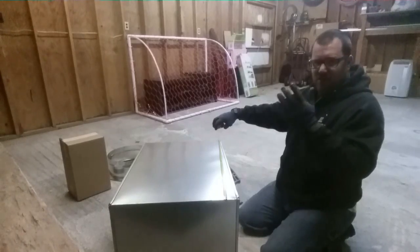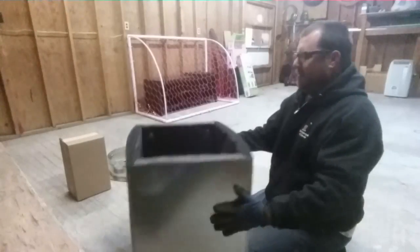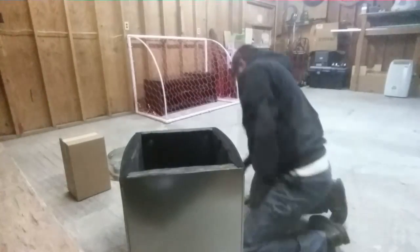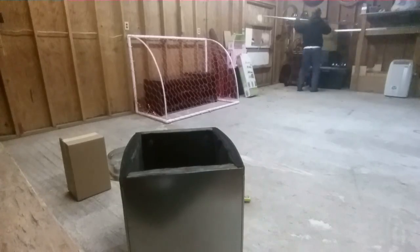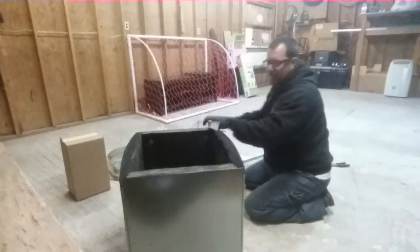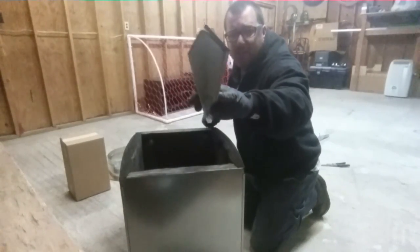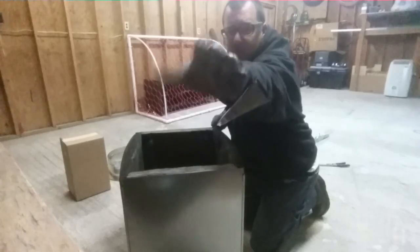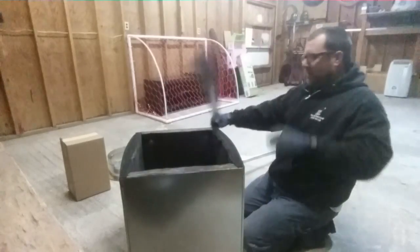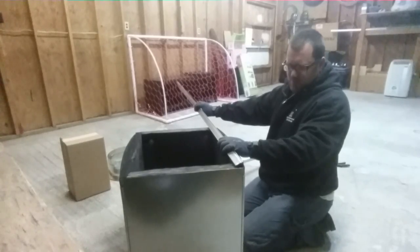For cleats, I'm going to use the 90-degree standing S-lock, so I can get my cleats cut to 17 and a half and 21. It comes in ten-foot sections. Here's what it looks like on the end. Regular S-lock of course has a section missing — it's just the S-part. With standing S-lock on base boxes, you have a shelf that things will sit on, and that's what I'm going to do here.